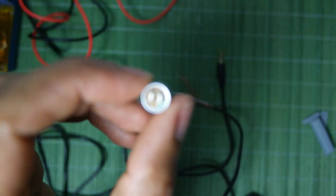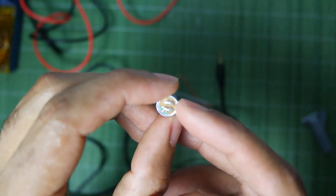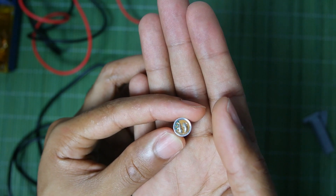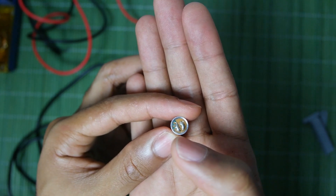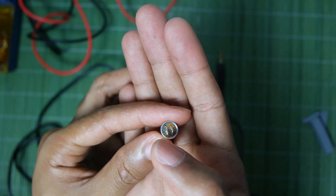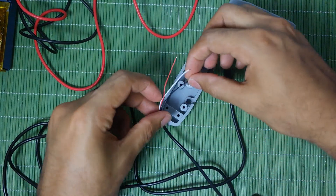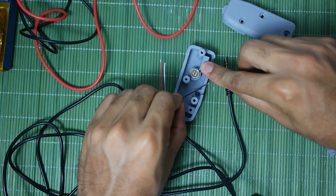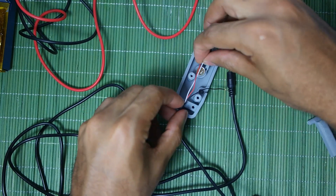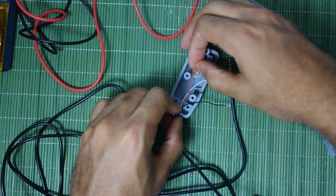In the microphone element, it has two connections — one here and another one here. This one here is the ground; you can see that it has three leads going to ground. The other one doesn't have any leads. The ground is basically going to be the casing of the microphone, connected to there. The other one is the positive. What I'm going to do is bring the ground from here to there, and also to this position of the push to talk. Then this will go to the push to talk here, and this one I need to short so it can go to positive with the microphone.